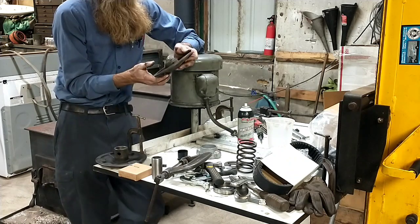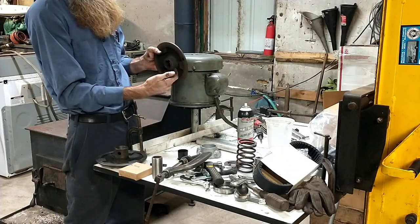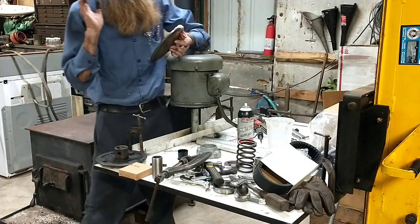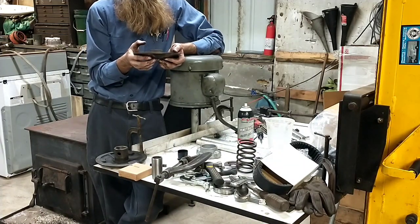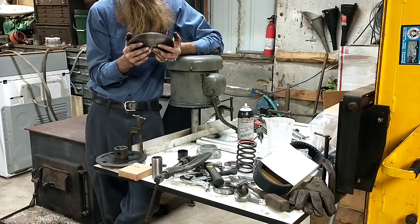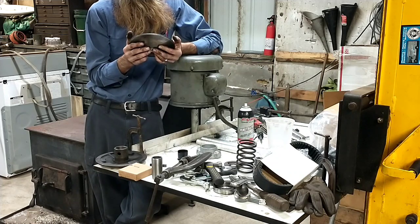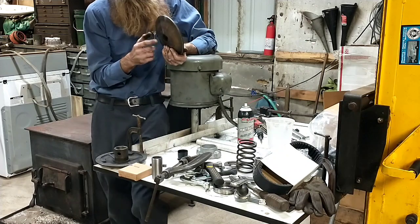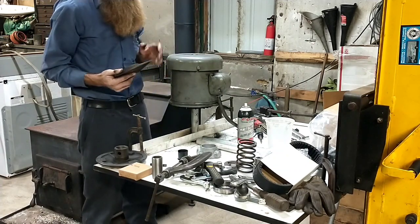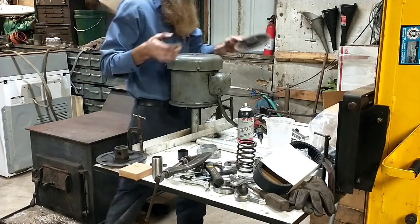Now, I've discovered that it works the best to get the heat in from the backside. The problem with that is it's guaranteed to ruin the bearing. But if you're replacing the motor armature, you ought to be replacing the bearings anyways. So I would just suggest you put a little load on it and go to it, because otherwise I think this is like a couple $100 part and there's no reason to replace it. It's never bad. It only ever gets wrecked trying to remove it.